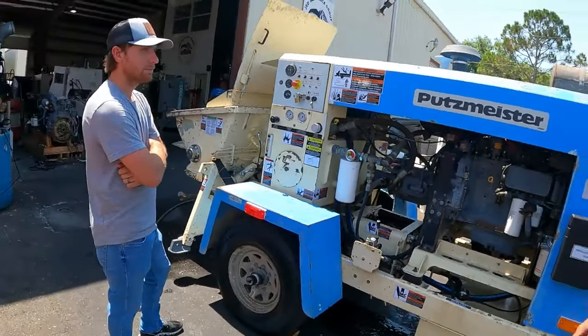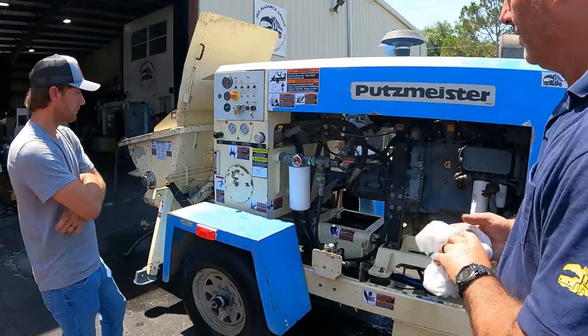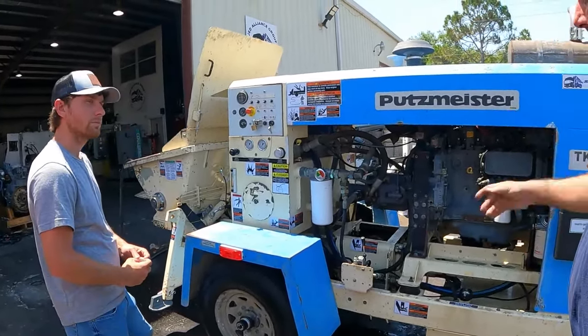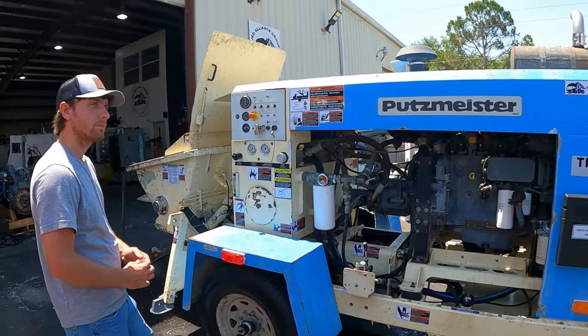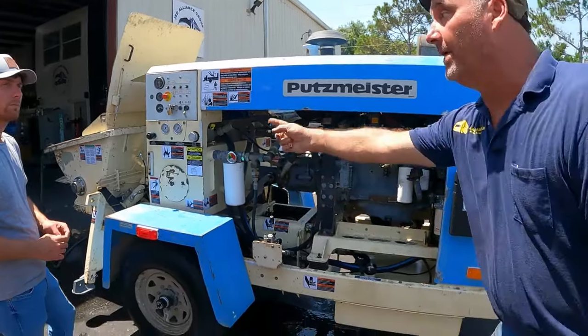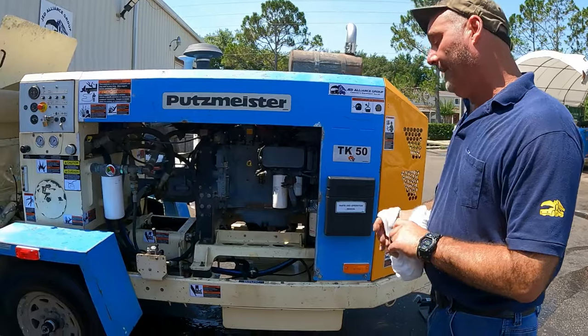Hydraulic fluid's like your blood, so if you keep it clean, you're going to have a good life. If you keep it dirty, you're not going to live long. We scrubbed the tank down already. There's a set of magnets that hold, it's called particle migration, and where the stream goes, or the fluid, you can kind of see as you look in there, you can see the dirt, you actually make a stream, you can actually see it. So that's where we place the magnets in the stream.